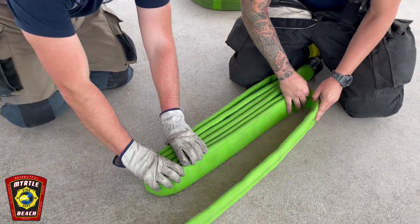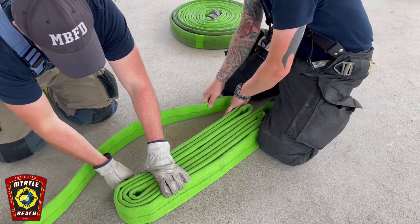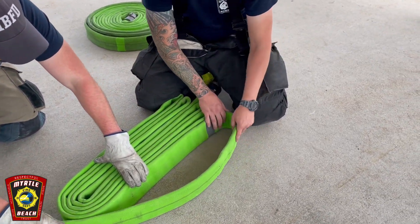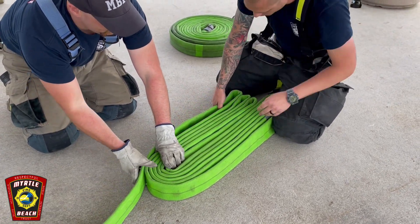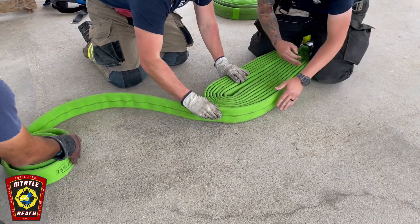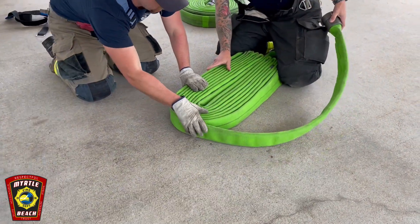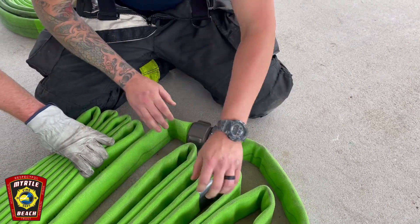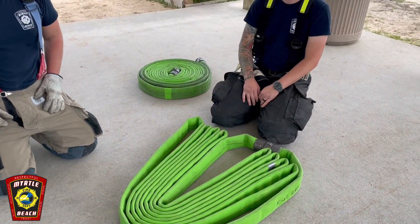Come around to the top again keeping everything tight. Your next fold is going to be right in line with your first one, and we're simply going to go back and forth, making each fold on either side, keeping it taut with your knees. We have a reference mark with duct tape at the halfway point of the hose at the 25-foot mark — that's just for reference. Keep all your folds tight going all the way around. Your last fold will end with the female coupling. Coming down, make the connection with the male — just do two or three turns, no need to tighten all the way. You have your bundle.